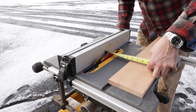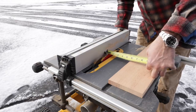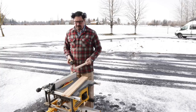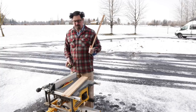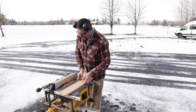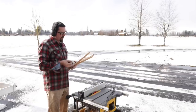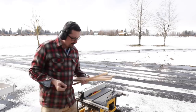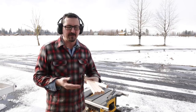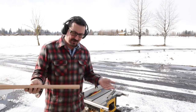We've got our final board cut to length and we're going to go three quarter exactly to the fence. Well, that didn't exactly work out as planned — apparently you can't get eight out of a one by six, you can only get six. So we'll go with that. The beautiful thing about carpentry: there aren't any rules, you make it up as you go. Here's what I did wrong: when I originally ripped these down to three quarter, I should have ripped them to half. Had I done that, I would have gotten my eight pieces instead of six, with half as many cuts.